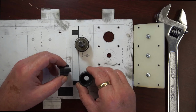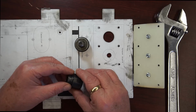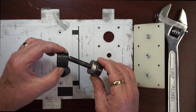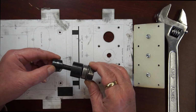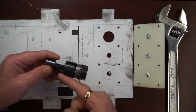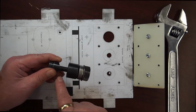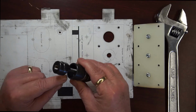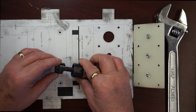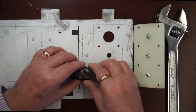It works like this. There's a cutting cylinder which slides into a hollow base. This bolt passes through the base, the workpiece, and the cutting cylinder is threaded on. When the bolt is turned, the cutting cylinder is drawn through the aluminum sheet up into the hollow base. The sheet is reinforced by the lips on this hollow cylinder. This ball bearing race makes it easier to turn the bolt against the friction.